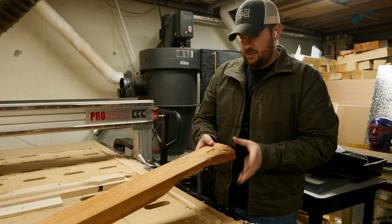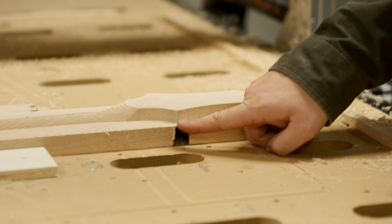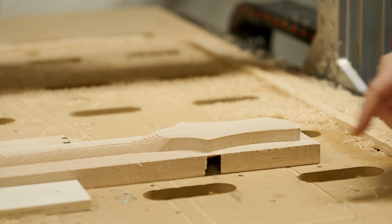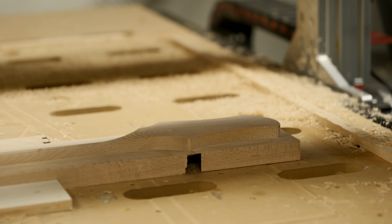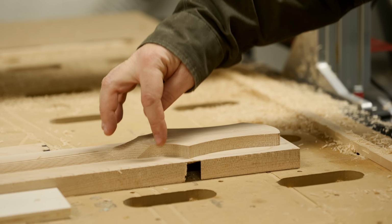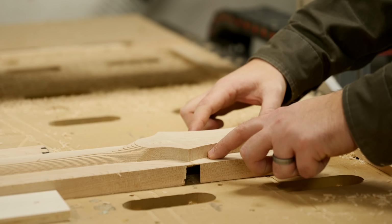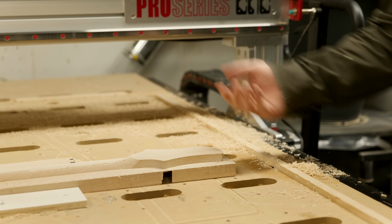So now I'm carving this side, which looks great. But as you can see right here, this is the amount of material that is holding this whole thing in place, is this much overlap. So if I do the smoothing pass over here, which I plan on doing, and then a final contour to cut the whole thing out, hopefully this material up here will be okay, but if I do the contour, the whole thing is going to collapse because there's nothing underneath it.